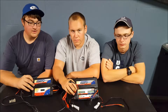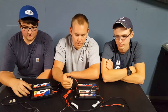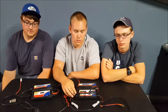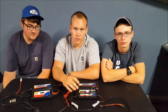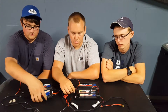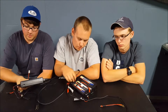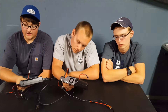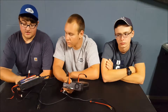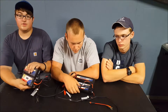So Jake, do you want to take the specs on the 245? The specs on the 245 — it's very similar to the 235 other than that it's a dual charger, an independent dual charger. You can charge a lipo, a nickel metal, or a whole bunch of different things. They both do lipo, LiFe, NiCad, nickel metal hydrides, and lithium ion. It does have built-in balancing, 10 model memory, and zero to eight amps.